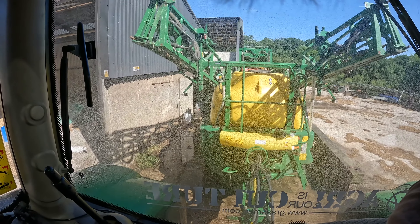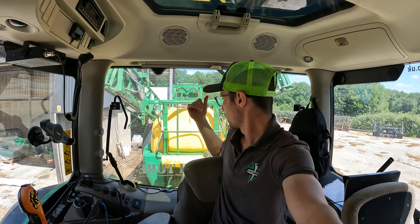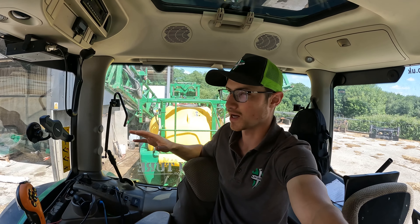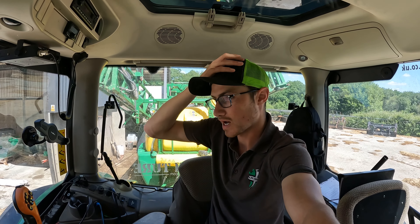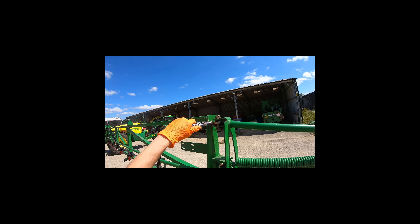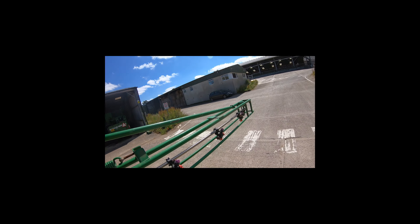Now I'm going to go out and give that a good wash. So that's the sprayer all cleaned up - I'm giving it a once-over wash on the sides and everything, under the wheel arches where they really attract mud. I've reset the plug - there's a handle on top of the sprayer you can pull to release a plug in the body to drain the tank. What I'll do now is take it up to the workshop, fold it out, and put a bit of grease in every grease nipple just in case any water has got in there. There are only little bearings - they don't need a lot. There's even an oak plant stuck in there - get out of there!